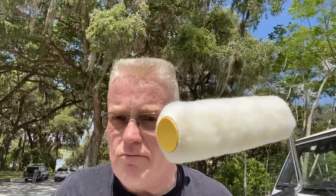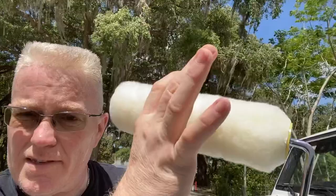With this wall covering you can't use a conventional smoother - for obvious reasons. If you've been hanging for six months or more, you know that you can't run a smoother over this. You might start and realize you're knocking off half the glass beads, which is a major problem. This is not cheap wall covering. So we're going to install it in a non-conventional manner using a roller - one that's completely unable to scratch the wallpaper.